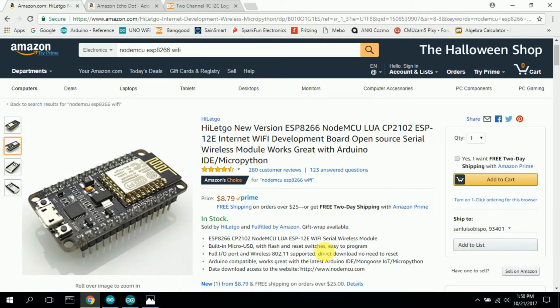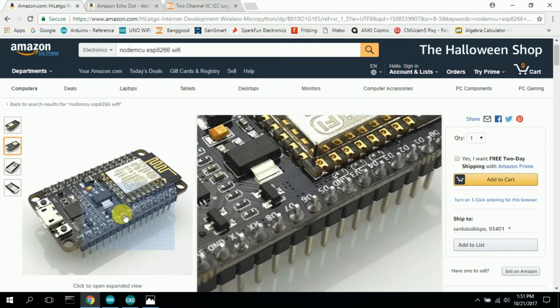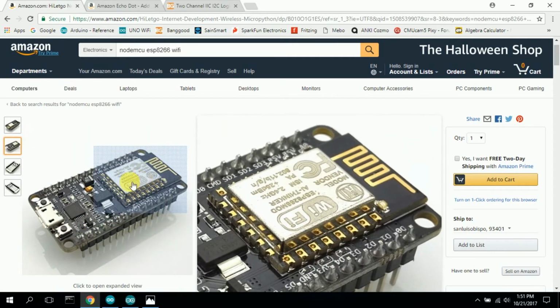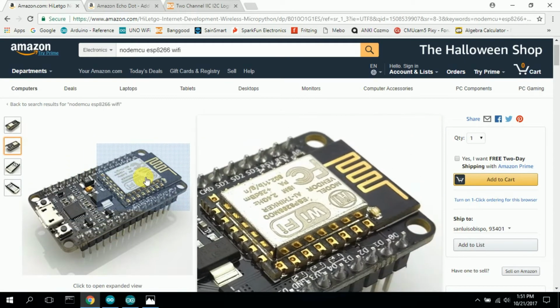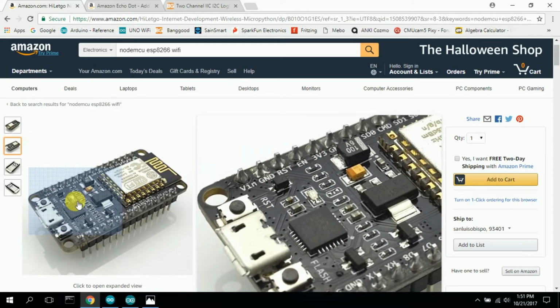and control other devices. And you just hook up to these pins here. You can see there's a D7, a D8. There's a number of pins. They all work basically the same. This board is a 3.3 volt board. So some 5 volt devices, you've got to be careful. They won't work. But the Wi-Fi on this works very well, and it's easy to get to and access.